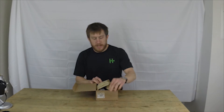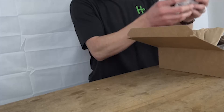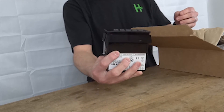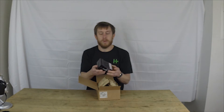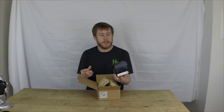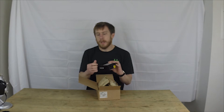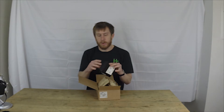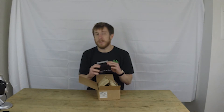While I'm opening this up, I'll tell you that the PAC meters are a small, one-eighth DIN — which basically means the cutout hole for the panel is 3.62 inches by 1.77 inches. The cool thing about these is that they have a very narrow overhang when you slide them into the hole, so you can fit more meters if you need to fit into a smaller panel. These are a little bit easier to squeeze together than maybe some of your other meters that have a very large overhang around the cutout hole.